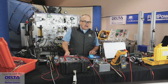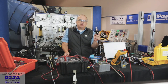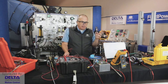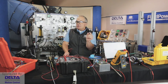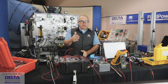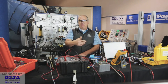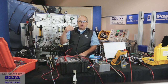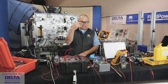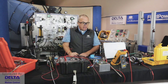So yeah, an open loop hydraulic system, well, okay, so we won't spend so much time today talking about open loop versus closed loop hydraulic systems, which is about the path that the oil takes through the system and whether it returns to tank or back to pump. That's open and closed loop hydraulic systems, but today we're going to spend a bit of time talking about closed loop control systems, and so there's a bit of a difference there. If we look at a closed loop control system, that's where we're measuring some parameter out there, such as position. We're going to get to that one last, hydraulic cylinder position, and then measuring to see whether or not we arrived at the exact position we wanted to, and then use feedback to send a correcting signal. So we're going to work with that as a type of control system. But I hope that helped answer your question, Machines Channel.